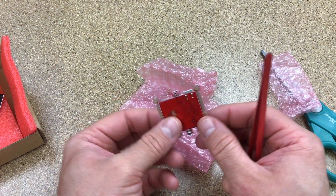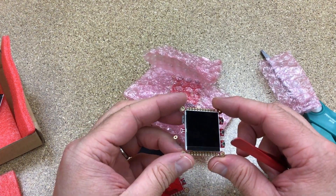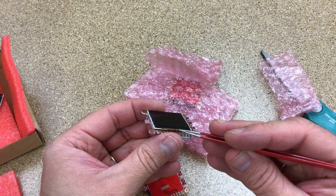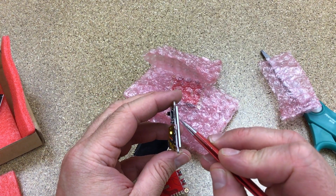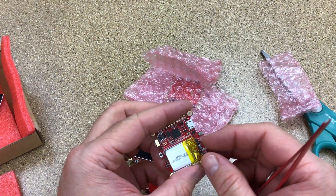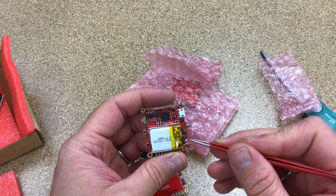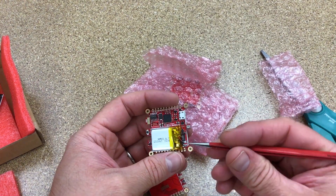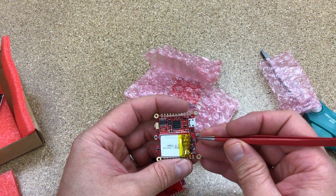Let's take a look at the circuit actually working. I have my display attached — notice the flex cable folds underneath. I'm using some 3M two-sided VHB tape to hold the display down, which works out pretty well. I attached the battery with that same adhesive and just ran direct leads down — I didn't use the standard JST connector that comes with these lithium polymers, just to shorten the wires. Let me turn on the little switch.